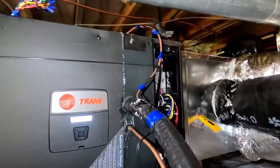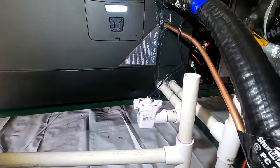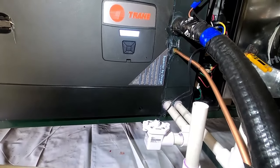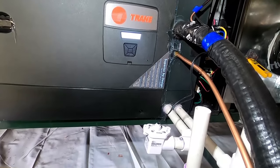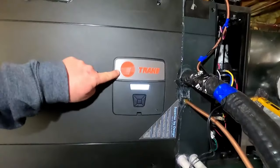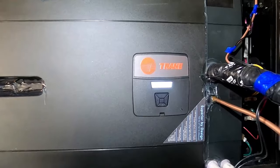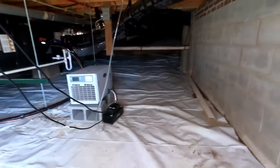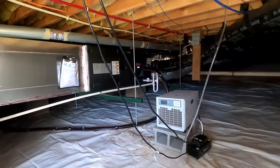Anyway, that's a rough overview - this system is running fine and everything's operating like it should. The biggest issue was the thermostat being swapped out, and you saw the sensing bulb capillary tube line off that TXV outside. I don't like them being bent like that - eventually we're going to get one that's shutting down and not working like it's supposed to. That's a quality control issue that comes from the factory. Like and subscribe, comment - and oh, by the way, you've got to love the nice crawl spaces when you get a chance to work in them - some of them are nasty!